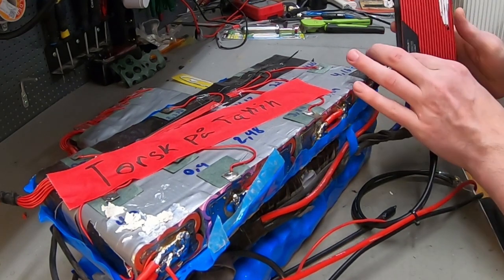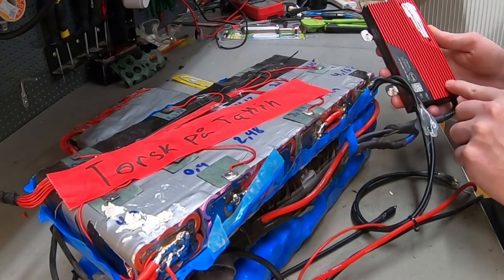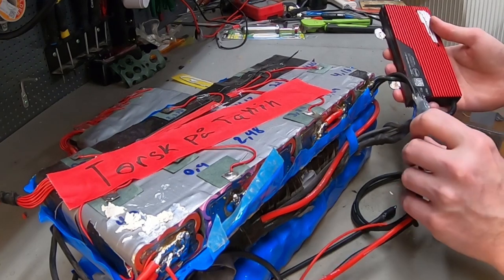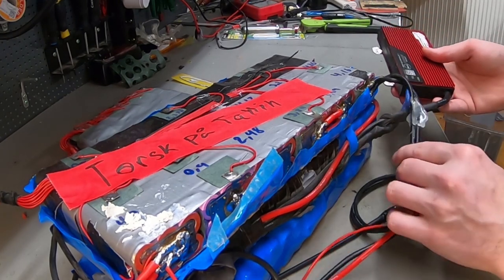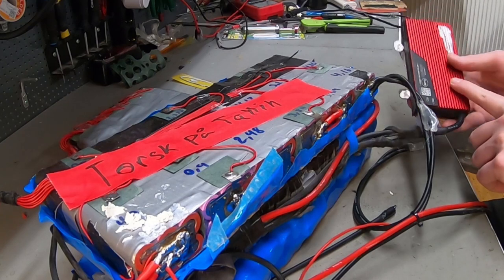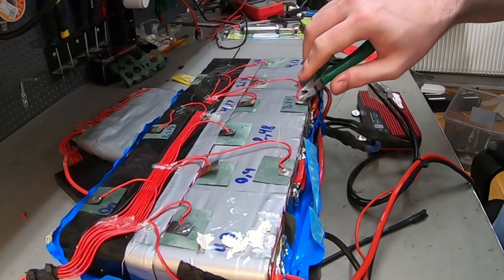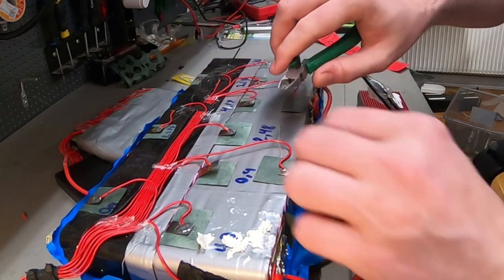And here you can see probably a Daly BMS. I don't know why they're using silicone. This is supposed to have a plate over here, but it might have been removed. So there's no information about how many amps or voltage, but they have 7 AWG wires, and these types of BMSs are for 80 amps and above. Really, really messy. I'm coming to save you, little cells. Don't worry, I will save most of you.